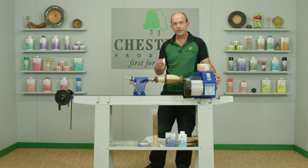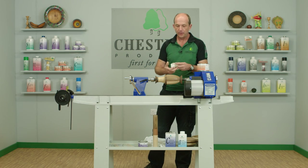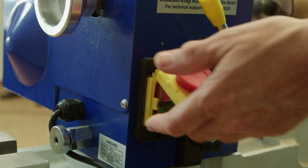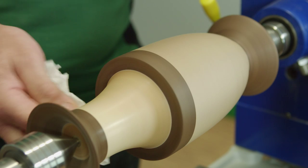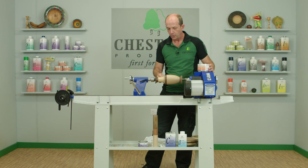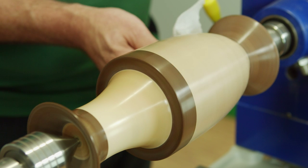As with all finishing, the thinner the coating the less prone it is to getting damaged. You can even use white nyweb for that. That's ready to buff up — we'll let the lathe do the work for us, so we'll turn the lathe on. With a clean piece of cloth we just press against it with fairly firm pressure and the lathe does the work, and we polish up.